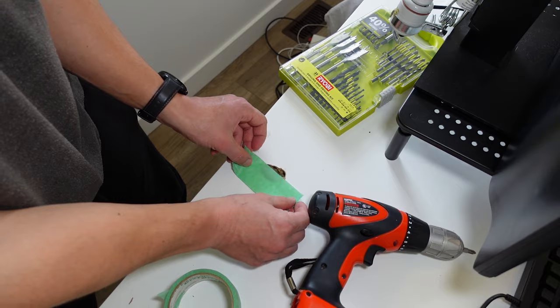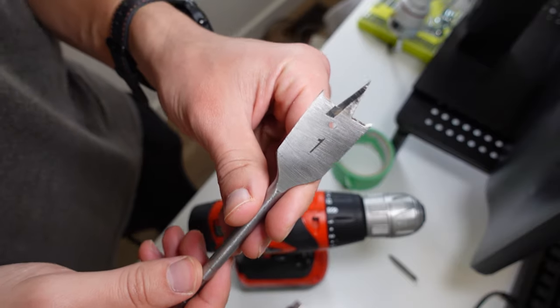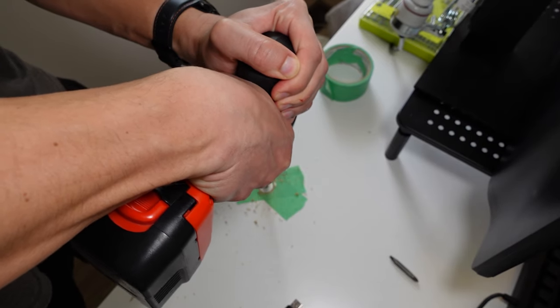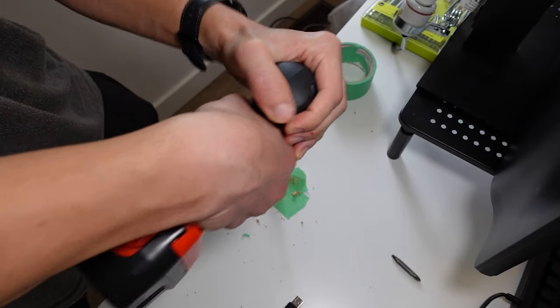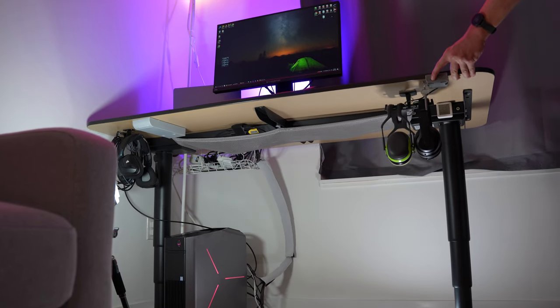Before you go out and start drilling holes into your desk, I want to give you a few pointers to protect the wood. I highly recommend putting some painter's tape around the drilling area so that you don't split the wood. You don't want a hole that is too small where cables can't fit, but you also don't want something unnecessarily large. I think 1.5 inches in diameter is the sweet spot — I was able to route a ton of wires for my monitor, laptop, and PC. I even drilled another hole to route my IKEA lamp through my desk to make use of desk space in my tiny apartment, and moving the desk up and down still totally works.